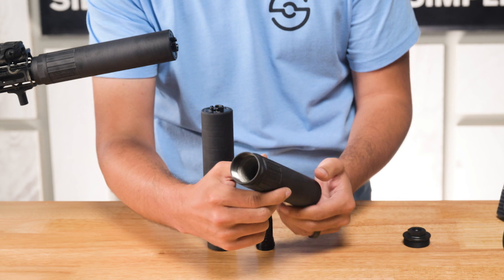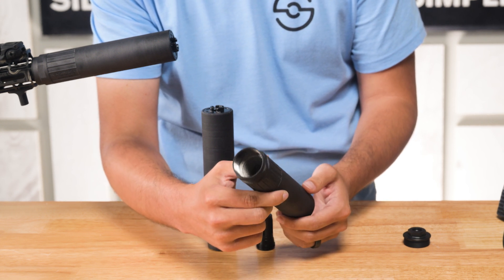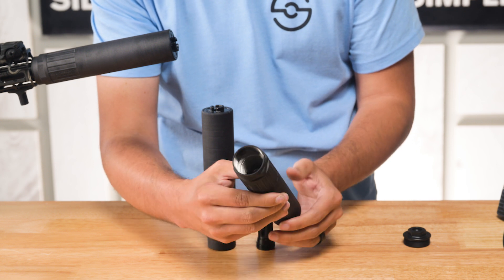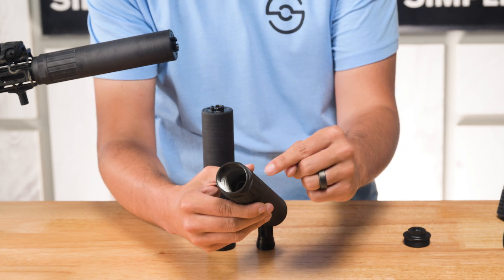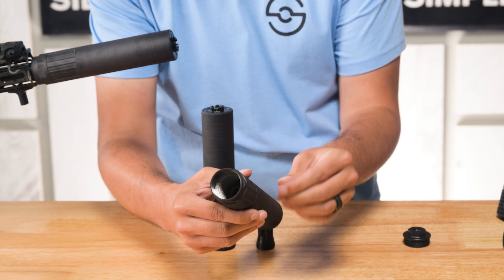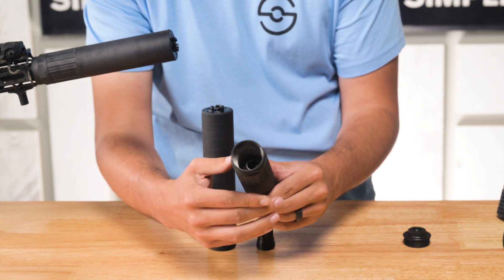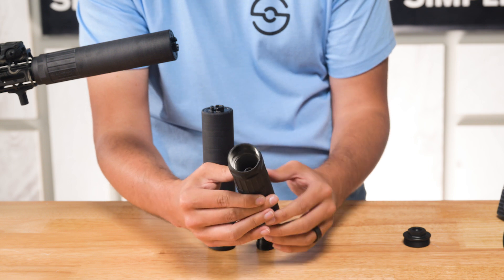The hub mount will be compatible with other aftermarket options and direct thread mounts. We had good luck with the Dead Air QD systems using their P-series adapter ring, and it also seems to work with SilencerCo accessories. However, because of the internal taper and CAT's Diverge technology making use of all the interior diameter of this silencer, some hub mount accessories might not work with your CAT MOB.